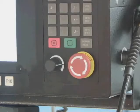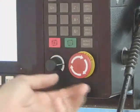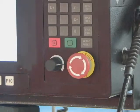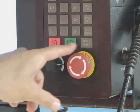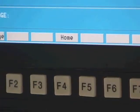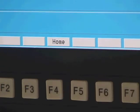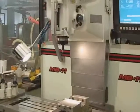One of the first things you will have to do is power on the servo motors. First make sure the emergency stop is not activated by twisting it to the right — it will pop out. Then push the servo reset button to reset the servos. At this juncture you will hit the home button, F4, and the homing process will take place.